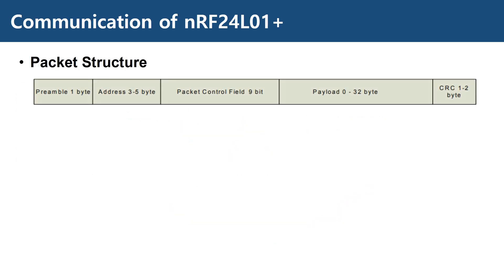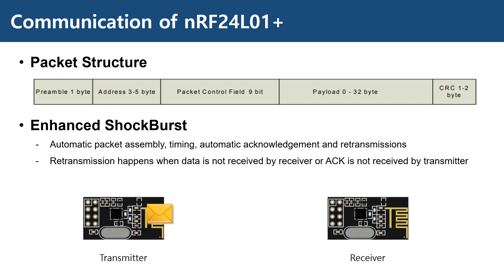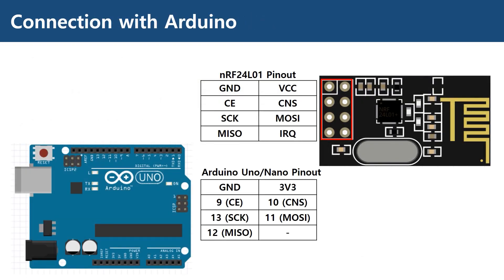The packet structure is shown on this page. It is the role of the enhanced shockburst baseband engine to construct and deconstruct the packet. This engine also takes care of sending ACK to the transmitter or retransmitting when the signal is lost. Connecting to the Arduino is very simple. This is a connection example to the Arduino Uno — only 7 wires are necessary. The VCC is connected to 3.3V from the Arduino 3.3V pin, and the SPI interface can be connected accordingly. CE, or chip enable, and CSN, the chip select for the SPI, can be connected to any digital output pins from the Arduino — in my case, pins 9 and 10 respectively.